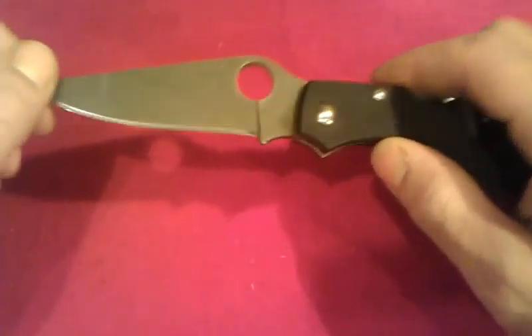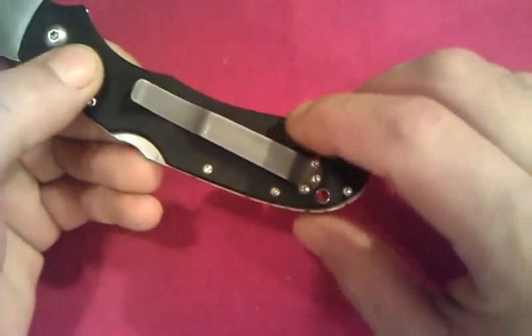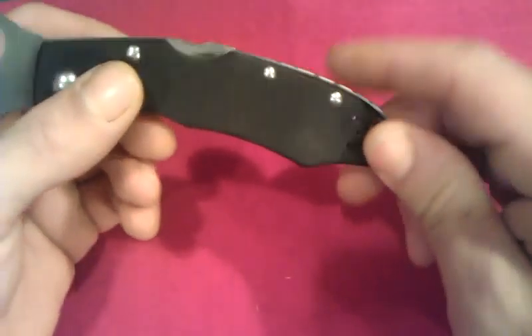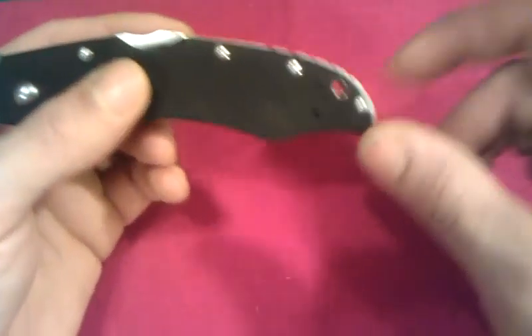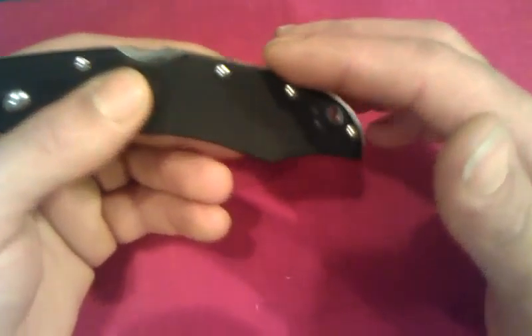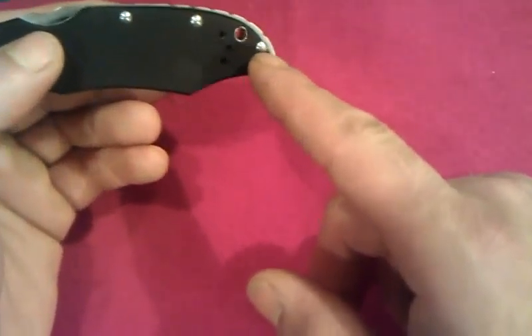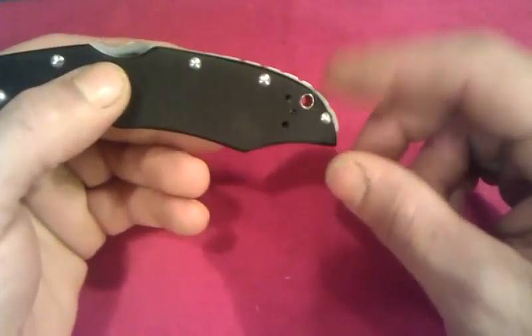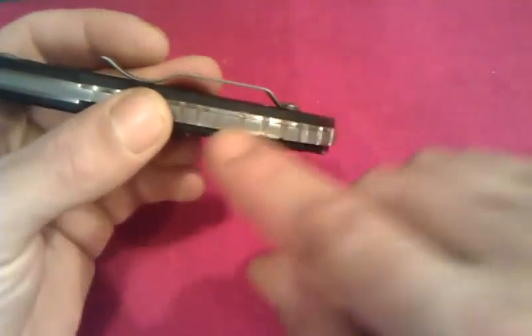Getting back to what I was going to show you guys — as you can see, I did an acid wash finish on this blade and also on the clip. I wanted to add a backspacer, but the only G10 I have in my shop is a quarter inch thick and this would need to be 3/16ths. So while I had the knife apart, I went ahead and tapered down the G10 all the way to where it starts to roll so it was actually flat — sanded the G10 to a straight angle — and that exposed the liner and the backspacer, which I then went ahead and added jimping to.